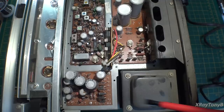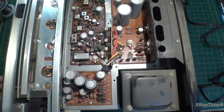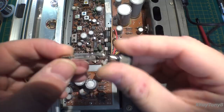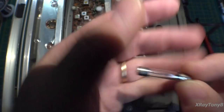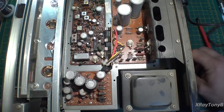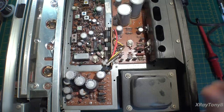That's not uncommon on these smaller built-to-a-cost amplifiers. The fuses sometimes only cover the speaker terminals at the output, but there is no fusing between your power supply and your amplifier section. So if something fails and you have a major short, it'll take that fuse out. And as you can see, here's the fuse — it has blown badly. You can see the little spot where it blew. So we know we have a dead short in here, and there's really no reason to even try to power this thing up at this point.